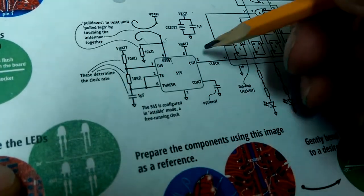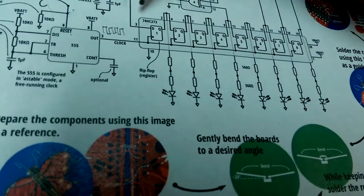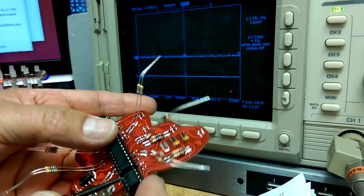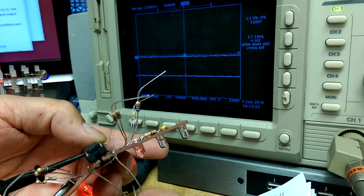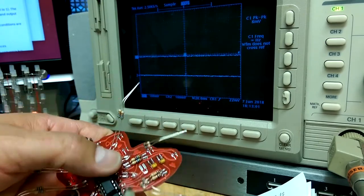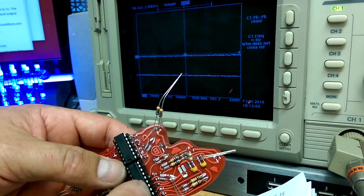And this 555 timer is configured as an astable multivibrator. So what it does is it produces a pulse train, which we're going to use as a clock to drive this octal D latch. Okay, so the 555 timer is in astable mode. So when we pull the reset pin high, which is equivalent to touching the antennae together, it will start a clock, essentially. A square wave on pin 3, and that is the clock signal that is going to drive these two chips,